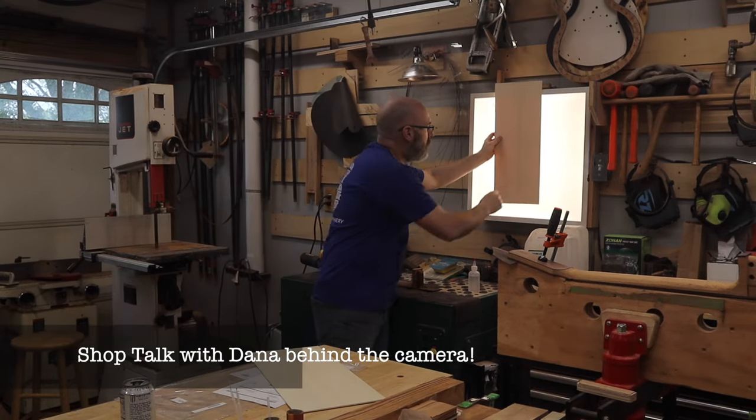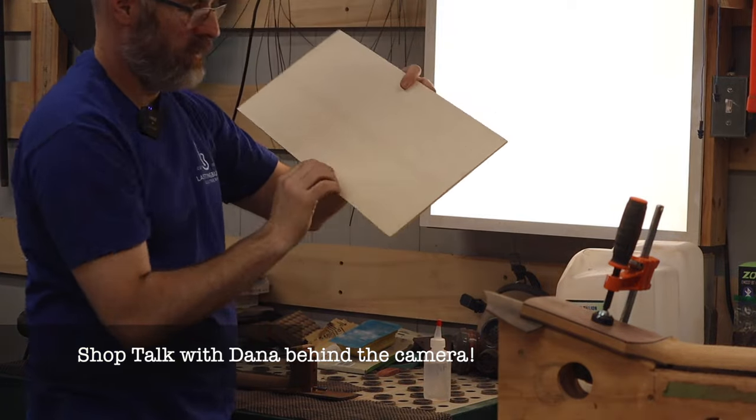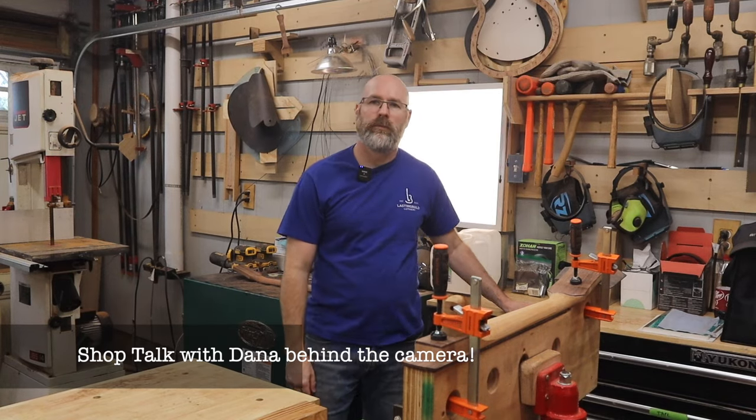This is a good example where there's quite a bit of light coming through the joint and it needs a lot of work before we can glue it together. This one hasn't been jointed or sanded yet, but it's a good example of how we use that light. You can see a little defect in it — clean as day in the light.